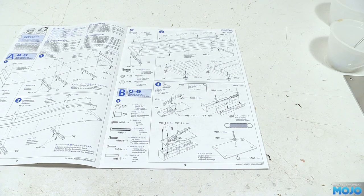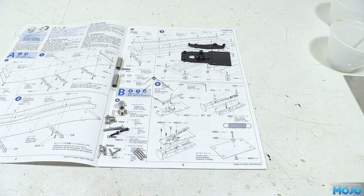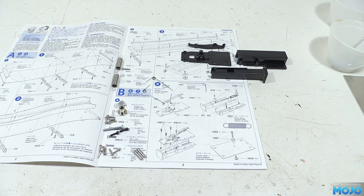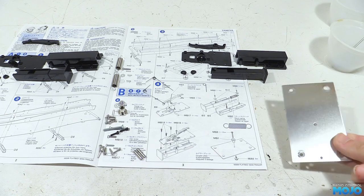We're up to step four: the legs and pin. There are quite a few bits for this one. We've got a single M3 flange nut, the pin for the coupler, six M2x6s, one M3x26 countersunk screw, two M2x8 cap heads, six 2x8 self-tappers, two 3x14 pins, two scissor springs for the latch, two coil springs for the return, B5 the latch, B8 the back plate, B9 the cover, B3 the leg, two B12 plastic washers — and of course there are two legs to build so we need two lots of all the plastic parts. Lastly there's the plate for the pin.